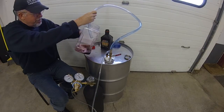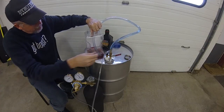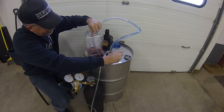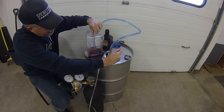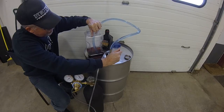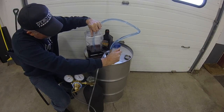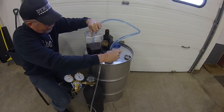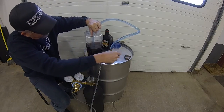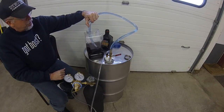Once that's all nicely mixed up, take your fuel hose and go to the bottom of the container. You'll see how nice and gentle that is — there's no agitation. Fill it up and while it's doing that it's mixing the oil and fuel beautifully. You can see it's all a nice uniform color, and we have hardly agitated the fuel at all.